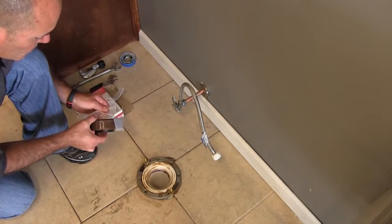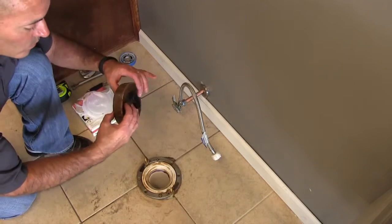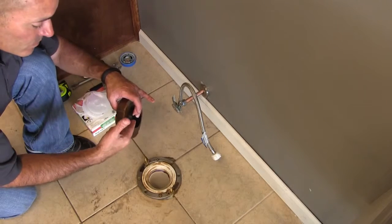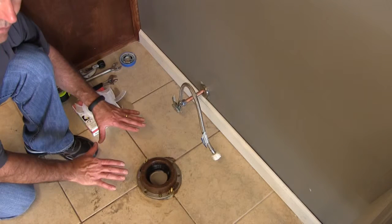In this case it's got a flange already inserted into the wax ring, which is the kind I want to buy. I'm going to set it onto my flange so that when I put my bowl on, I squash the wax ring onto the flange — that's what seals the bowl to the flange so each flush it does not leak.